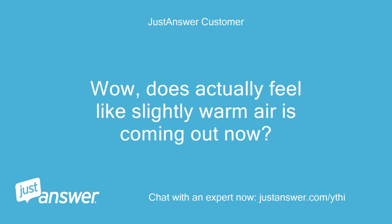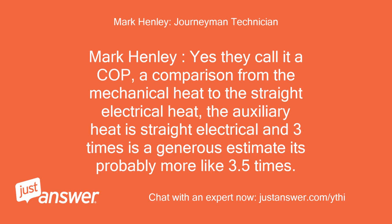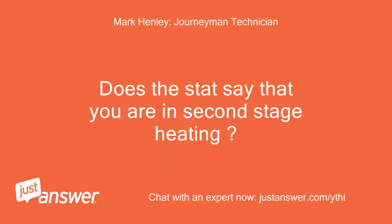Wow, does actually feel like slightly warm air is coming out now. Mark Henley, yes, they call it a COP, a comparison from the mechanical heat to the straight electrical heat. The auxiliary heat is straight electrical and 3 times is a generous estimate, it's probably more like 3.5 times. Does the stat say that you are in second stage heating?